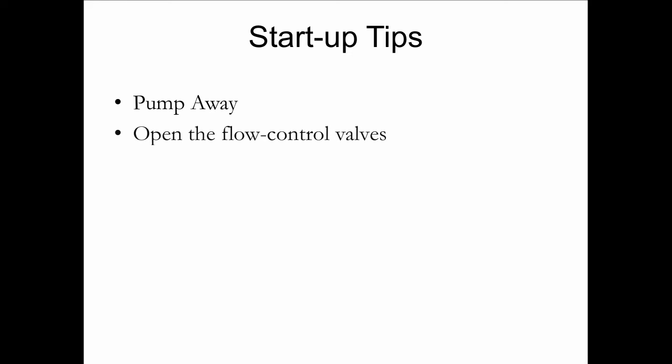If you're working on a job where you're just making some repairs and you drain the system and now you've got to get it going again, and it's the flow control valve that has a crank on it where you can lift the weight, by all means lift the weight to take that away from the pressure drop of the system, and that will help you get the thing started up again. See, the problem with the diverter tee system is when you're purging it, you're purging through the main lines.